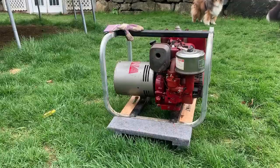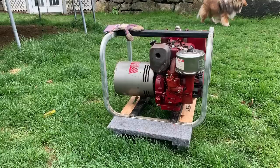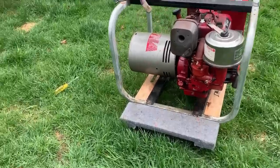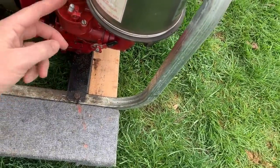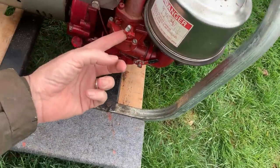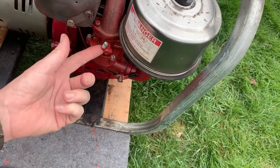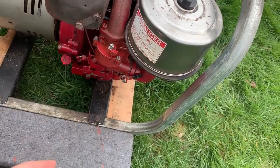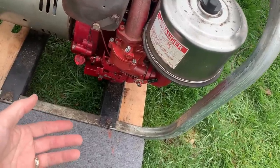Okay, so that was a bit disappointing. Under 3,000 watt loads, the generator was heading to stall. You know, it was around 50 hertz, 49 hertz, 48 hertz, just dropping like a rock. So, one thing I discovered is that while it was dropping, I tried to just hold the throttle open and I realized it was all the way open. Like even under a 1,500 watt load, throttle was open all the way. So she was giving it all she had. And it just couldn't power it.